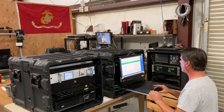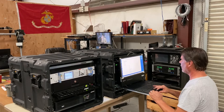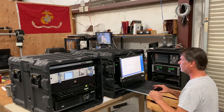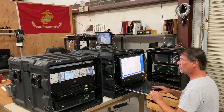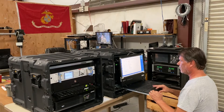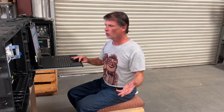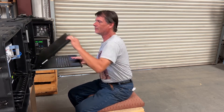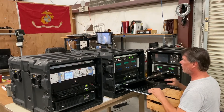You can control any outlet that you want. In this case, I am going to cycle power to the antenna control unit. You choose your actions — in this case, reboot immediate. You choose just the port you want to power cycle, hit next, and then hit apply. Just like a lot of other things computer-related, they keep coming back and asking you, are you really sure? And as you can see, it's turned off, and in five seconds it'll turn back on.